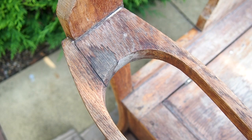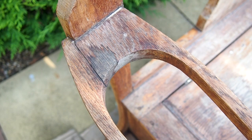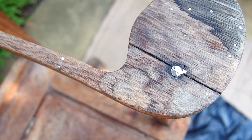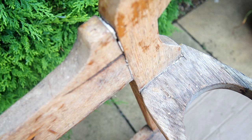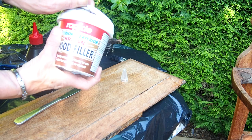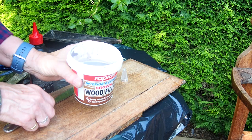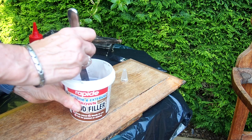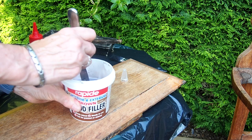The next step is to fill any cracks or nail holes to make it smooth. It's got fairly water damage here — perhaps there was a leaky roof. I think it was a dark chair to start with but it's really faded from being in verandas for very many years. So have a good look around your chair, find all the cracks, and then you can start to fill. I'm just using a ready-made wood filler for this project. I do have a video on making your own homemade wood filler and I'll leave a link to that in the description.